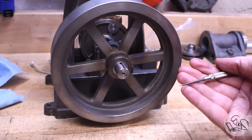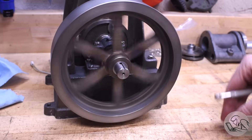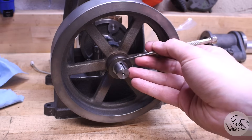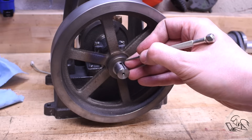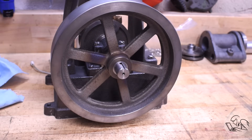What is a keyway and why should you care? Well, if you've got something big and heavy like this flywheel, it's just going to spin on the shaft. So what we do is we cut a keyway half in the shaft like this — that's easy, just do that with an end mill — but then we need to continue that gap up into the hub of the spinning thing. That is considerably more difficult because that feature has to be cut inside of a bore.